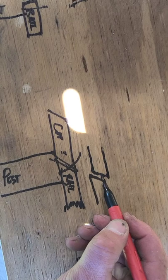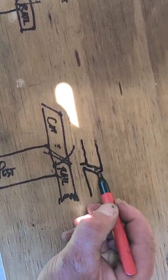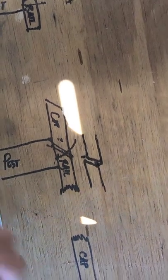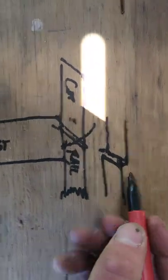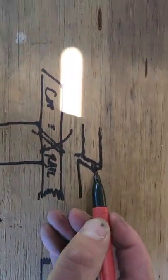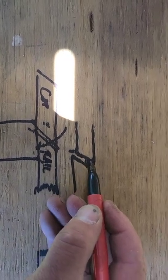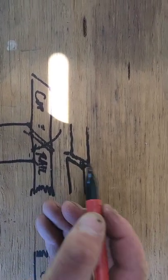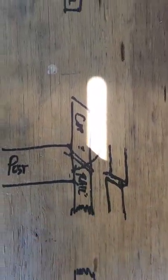To where it's kind of overlapping that corner. And then once you fasten this, that's going to suck this corner down as tight as possible. And that's what I did up there. I just got it clamped, but that's the technique that I'm using. And that's why that splice is really hard to notice, is because I picked it up and over a little bit and then clamped it down to where it's actually compressed into that other piece of material.